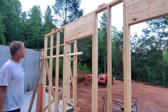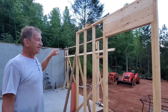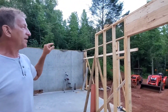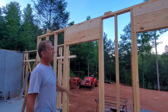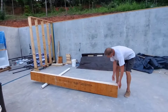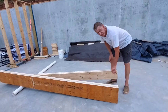Now we've got the garage to do. It's a 10-foot wide garage door and it's seven feet tall. I've got an LVL for that and that LVL is almost 12 inches tall, and then I'm putting another one on top of it, just like I did over here — a spacer — and then this one will go up afterwards.